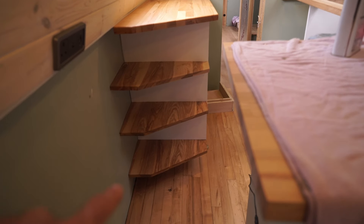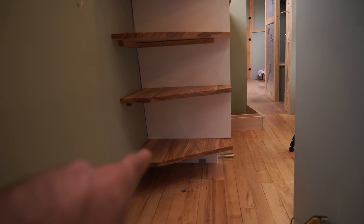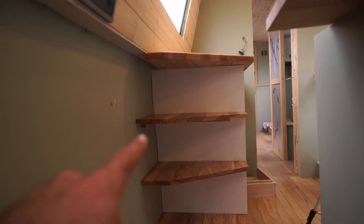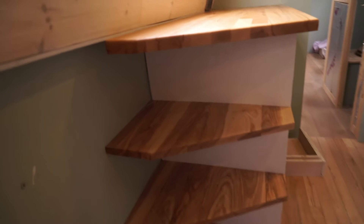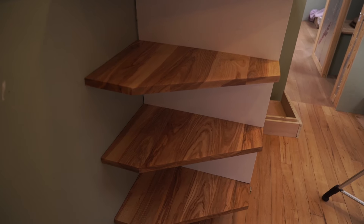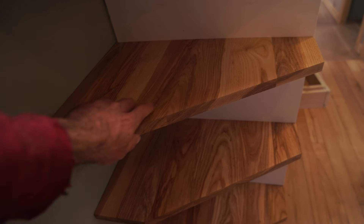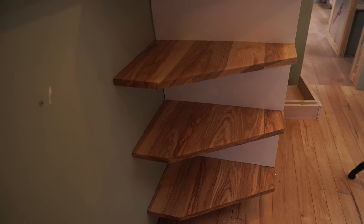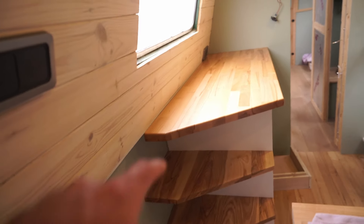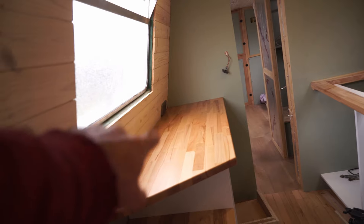This isn't finished yet but it gives the general idea. There's a kickboard going under here which is a funny triangle shape - that's at the workshop gluing up at the moment and needs painting. These shelves just float in the corner and I'm going to use them for plates, bowls and large saucepans that don't fit in the cupboards easily. I might need to put a little fence around each one since they're finished to a fairly smooth finish and stuff might slide around - especially on a boat. I've put four coats of Danish oil on the worktop now, so I think it's okay to fix down. I just need to rotate that plug and then fix it down permanently.